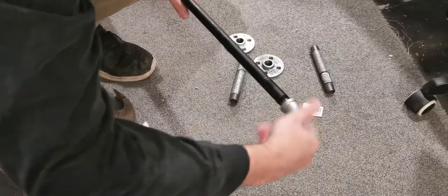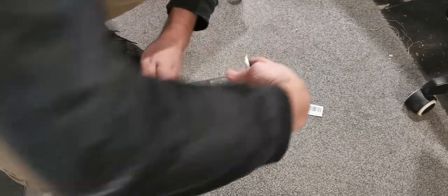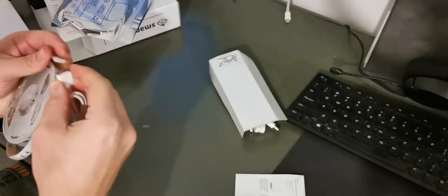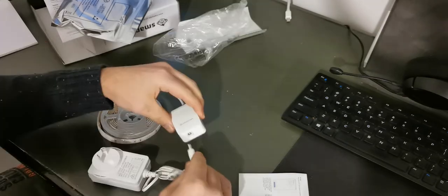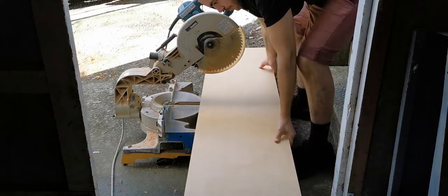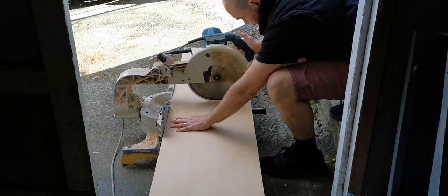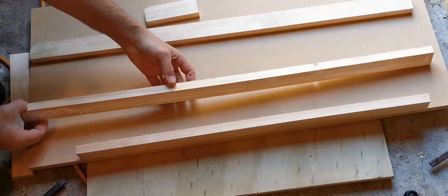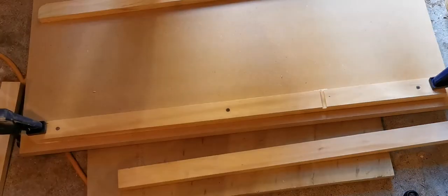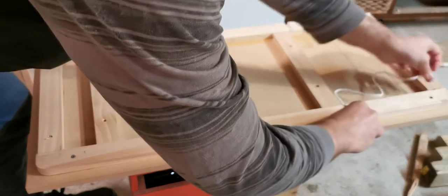Let's take some time to talk about the RGB panel that I made. First I put together some galvanized piping from a hardware store to play the part of my camera and lighting rig, set about 15 centimeters away from the wall. Next I got an RGB light strip — middle of the market from a local online game store — these work via Wi-Fi with a little Wi-Fi adapter. Then I got some MDF board, measured it out so my monitors could sit evenly with a little extra space either side. I glued battens to the back to set the board about one and a half centimeters away from the wall, acting as a spacer for the RGB light strip. There's also a little recess I cut so the wiring can be tucked away neatly.